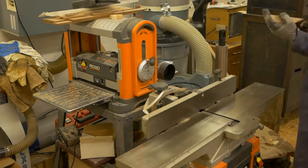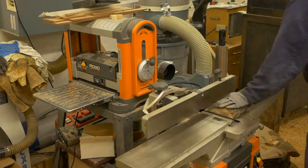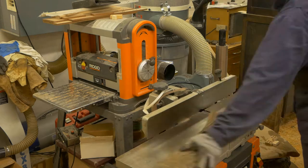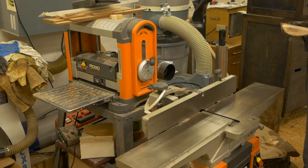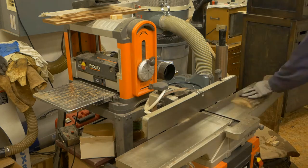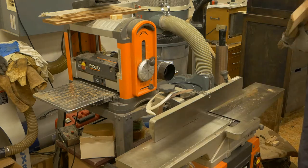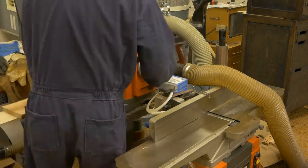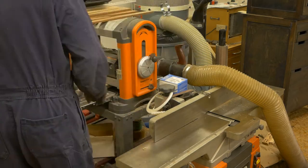I had to be careful here. I wasn't really planning on using the initial piece that I cut — in my mind I wanted to maximize the rest of the use of the log, and the initial piece was cut very close to the bark and was going to be scrapped. But after seeing the book-matching patterns I showed you in the previous video, I decided I was definitely going to use it. Since I was getting close to the edge, I left two low spots that I was going to sand away later. The low spots were far away from any design, so they wouldn't affect anything. Planing of the wood applied only to the top section.